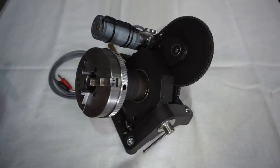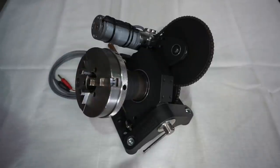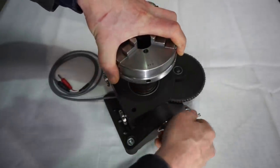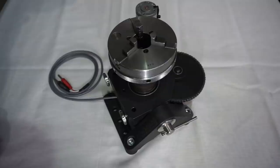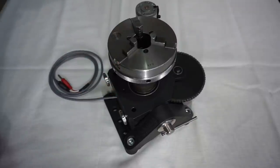So enough theory and back to our practical example at hand. I want this welding positioner spindle to be able to deal with loads of up to 100 kg, or roughly 220 pounds, with the spindle in vertical orientation. So this means maximum axial spindle load roughly 100 kg, and according to our rule of thumb from before, we must set the spindle bearings to a preload of roughly 50 kg if we want the bearing rollers to be in permanent contact with the tracks.